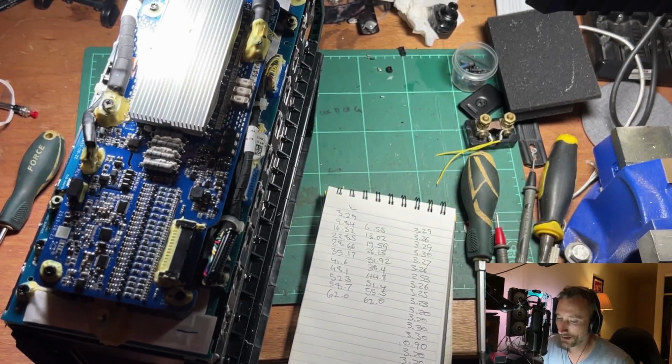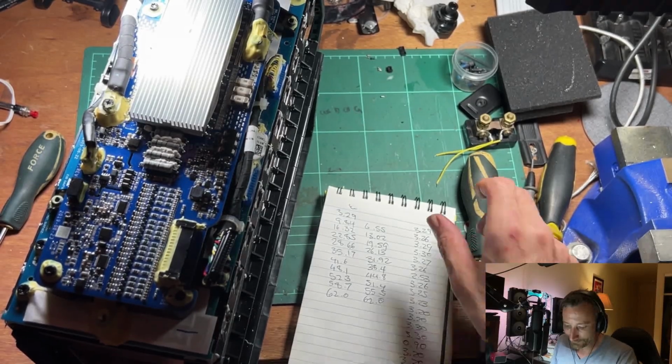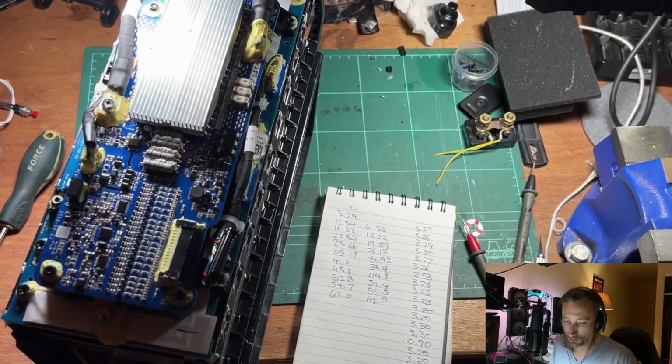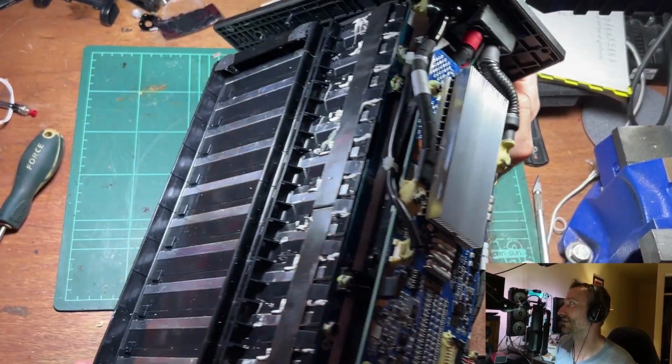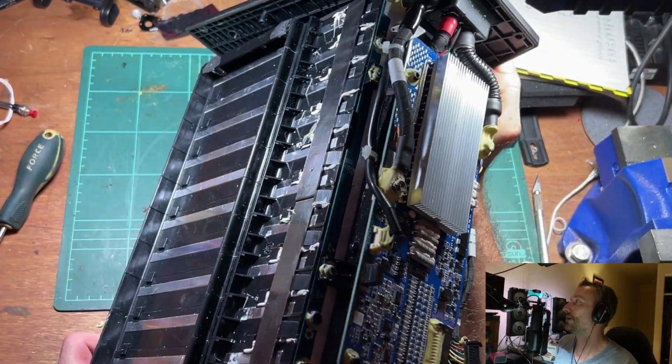I mean, one pack's buggered, so that would mean all of the cells in that one pack, 1 out of 20, are basically stuffed because they're all down at 0.9 and don't know how long they've been sitting there for. So yeah, I don't want to try charging that one individually because there's something wrong with that one. Yeah, which means game over. Whole thing, 2.5 grand battery pack goes back to the supplier, and I guess they can have fun with it. But there's a look at what's inside a 3.24 kilowatt hour lithium battery pack.